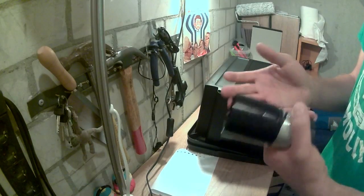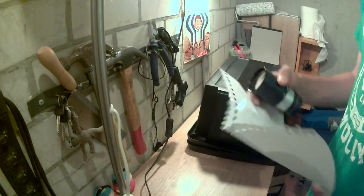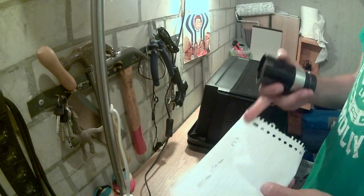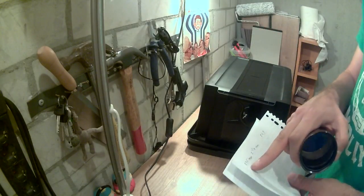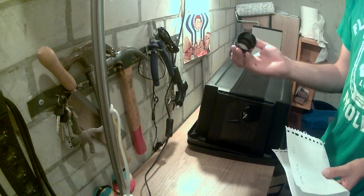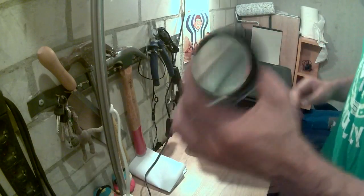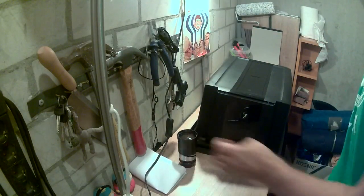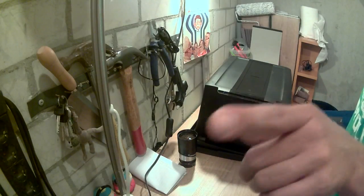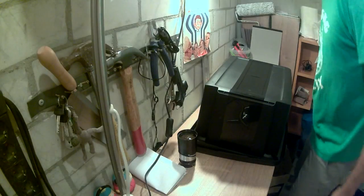It broke. I can't put it back together. I lost some pieces. So I took the front element, which is well calculated. It has 235 millimeter focal length, and f/4.7 are its characteristics as is. So it did give some pretty big, nice pictures. So you can see them in the links I might put on the screen.